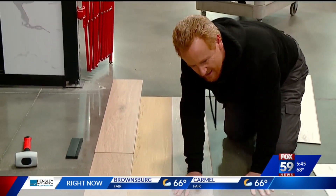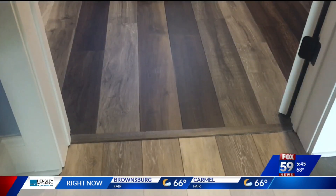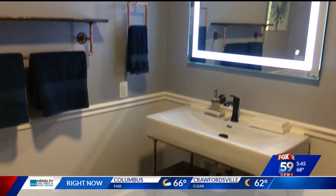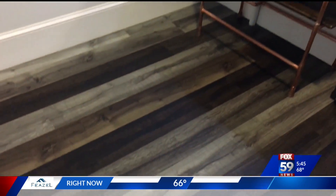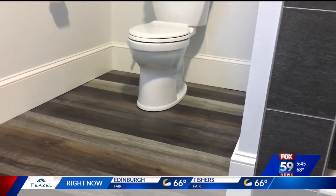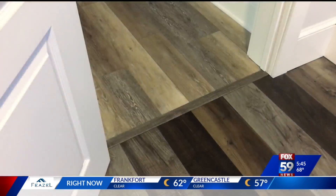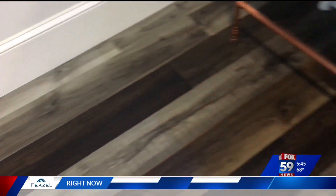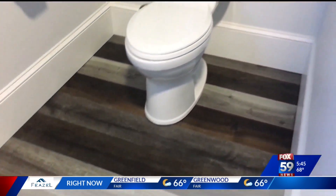I think this blends a little better. Back to my bathroom — I decided to use four colors that I thought went well side by side. You can use as many as you want. These are darker than the ones we laid out in the store. But here's the key: use the same color in the same row, end to end. Otherwise it can get really busy, although you could give that a try too.